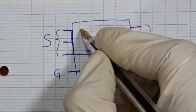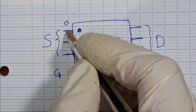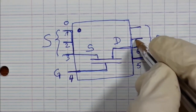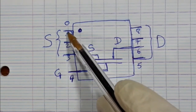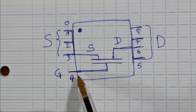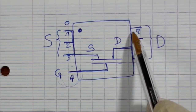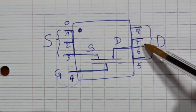So the first pin — we have the hole here and the white dot here. This is pin one, two, three. This is pin four. Always pin number four is the gate. We have five, six, seven and eight. Let's check this in the motherboard. We will check pin number one, two, and three — using the multimeter, we should hear a buzzer or continuity. Pin number four is isolated from these pins, and the four pins five, six, seven, eight are connected together, so we should also hear a buzzer and continuity.